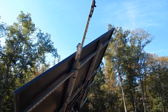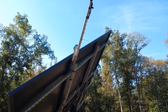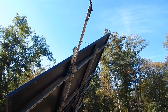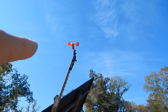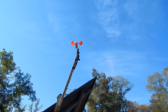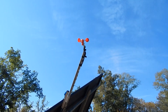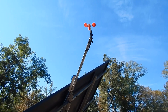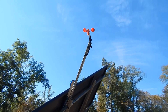There's the backside. I just took that small piece of unistrut and bolted it with two cone nuts to the top of the larger unistrut — that's all there was to it. Then I took that little piece of aluminum, bent it on a slight angle, and it picks up the wind whether it's all the way to the south or horizontal. It'll pick up the wind within 90 degrees. It was just that easy. I hope that helps somebody — that's the anemometer install and solar update.